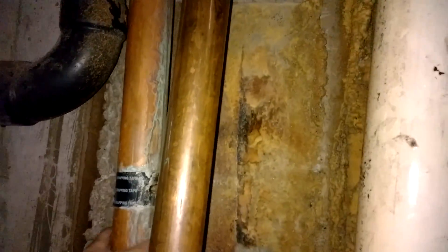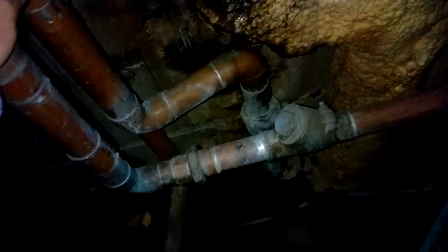Here's the chilled water, because the chiller's up there. Here's going into that chiller room, and then it goes into that boiler room I'm in. Got water flowing right here right now. Here's the fill line, it looks like off city supply. It ties back in there, and the other one's a recirc line.